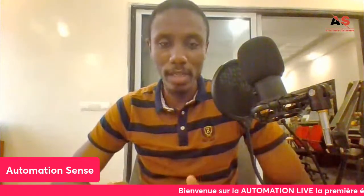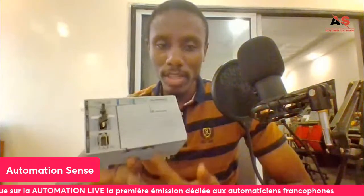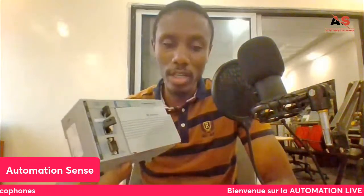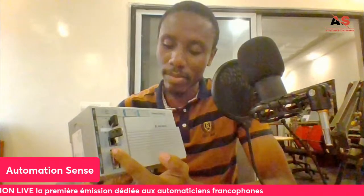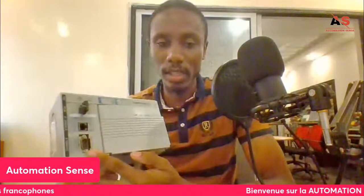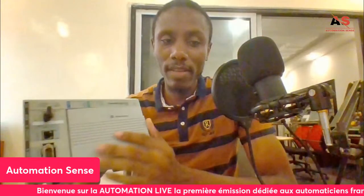For those who have never worked with Rockwell PLCs — the Allen-Bradley range — I strongly recommend the Compact Logix. It closely resembles Siemens PLCs: compact with integrated I/O. For communication, you can use two interfaces: Ethernet/IP via RJ45, or a serial interface via DB9 port. These two interface types make it very easy to connect to a programming PC.